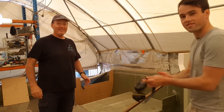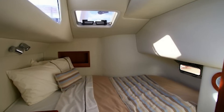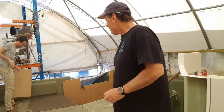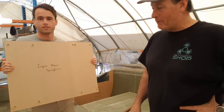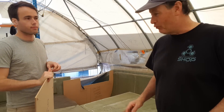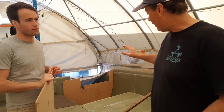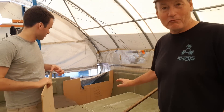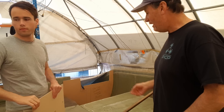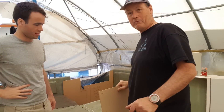What we're going to do today: that bed base down there is over the top of our engine bays. Sam and I have just been up to the factory and made a template of our engine mounts. We're going to get that bed base out, get the module out once we've tested it's going to work, then get that engine bay module out here and start reinforcing it — laminating and completing the reinforcement of the engine mounts. That's a pretty major thing before I can even consider demoulding.